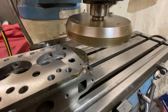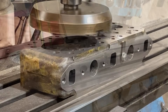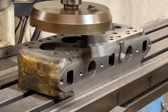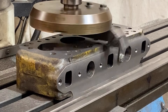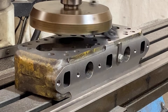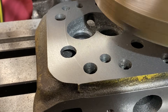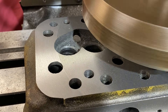The fly cutter cleans the whole head up in one pass. We're now pretty much down to size and I'm just going to take a very slight back cut — the cut will only happen on the back side of the fly cutter and this gives a nice finish which is acceptable to run with a gasket. As you can see, the fly cutter is doing its work and the back cut is there. Lovely finish — no chatter, perfect, nice and flat for our gasket.